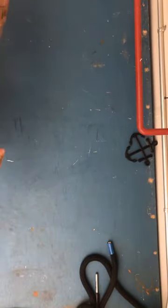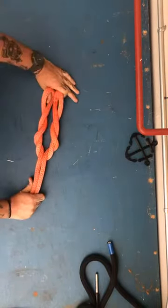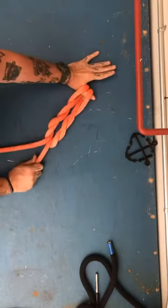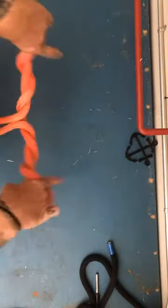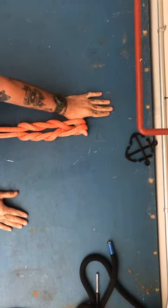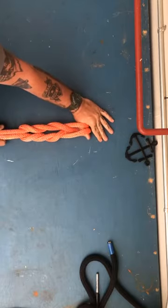Cat's paw — talked about this when we showed the hook video on YouTube. I'm just twisting this so I can put it on a hook, kind of like the start of a Spanish bowline, the way you twist. You put this on the hook. It means if your load shifts, it won't slide — it tends to bite down on the hook. So: I'm just going to twist in the same direction, and I've made a cat's paw. This is for putting an endless sling or piece of line on a hook for a crane, boom, or davit.